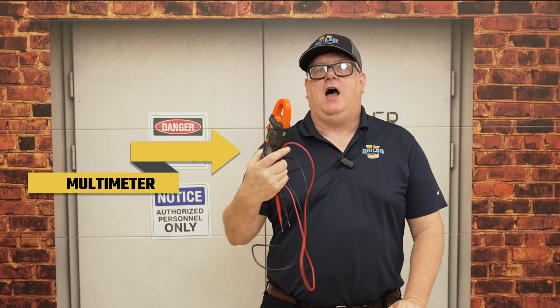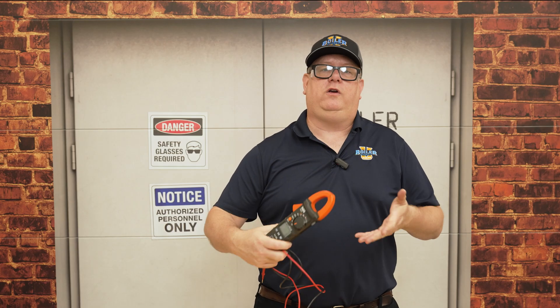First, a multimeter. I'm not saying they're not going to be able to find one in the factory, but if you're doing any troubleshooting on a boiler at all, you're going to need a meter — and you want to use a meter that you are very familiar with. Borrowing a multimeter can be a problem if you're not familiar with the settings. Some have movable plug-ins, some don't. Some beep automatically when you're doing continuity testing; some you have to hit the select button to get the beep to work. Basically, we want the home court advantage when using a meter because we need accuracy and precision.